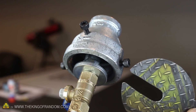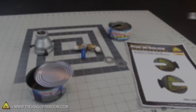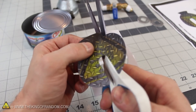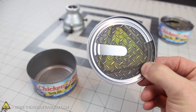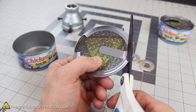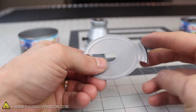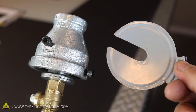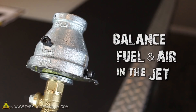It's a really good idea to have an adjustable regulator to control the air flowing through the torch, so let's make one of those next. All you need is an empty can of tuna and this air regulator template I made, which you can have for free — just look in the description for a link. Print and cut out one of the paper templates, then glue it directly to the center of the steel lid. The steel should be thin enough to slice with a pair of scissors, so carefully cut around the edges of the template, then gently mold it from the back into a bowl shape. With the center pressed in and the edges raised up, it should look a bit like a small steel shield. This slit on the side lets you slip the regulator completely over the intake port, essentially blocking off any air flow.